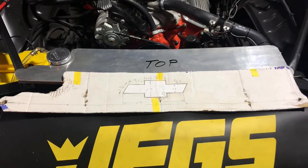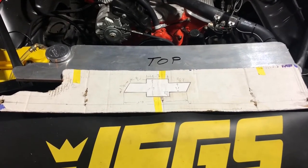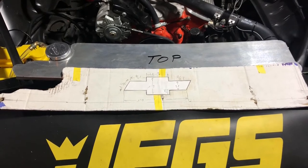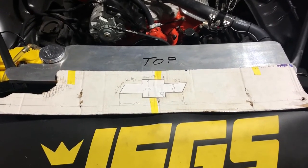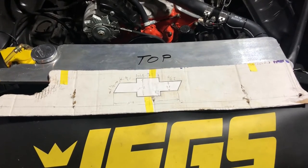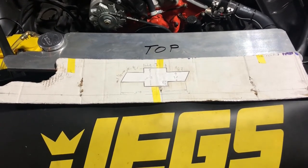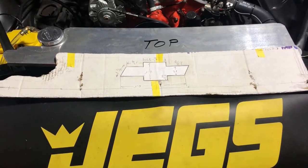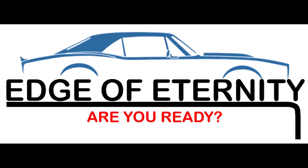Here you see the original cardboard template — my cardboard-aided design — and the aluminum piece. We're one step closer now with the flanges downturned. Like I mentioned earlier, I'm going to planish along the bead lines to stretch the material a little bit, install the beads, and then roll the flange. I still need to make a three-piece die to press the Chevy bow tie emblem into the center of the aluminum — you can see that on the cardboard template. That's the plan. I hope you enjoyed this and I'll see you later.